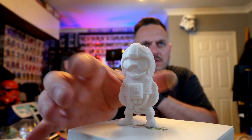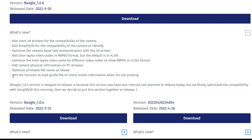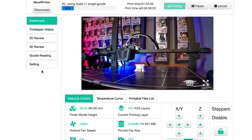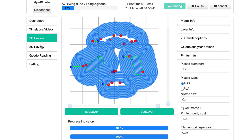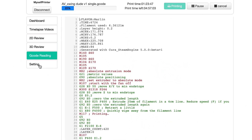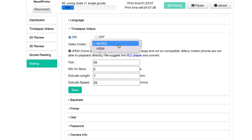The Beagle still has a little bit of work to do, so let's go through some positives and negatives. Number one: we certainly have ongoing software improvements — quality of hardware and adding software features will make this a clear winner. Number two: the web browser interface is pretty good, but I'd like to see more features, for example more time lapse settings in line with Octoprint, giving various settings and stop points. At the moment the head swings all the way forward and homes to the top left corner. On previous software versions it did this very quickly and was alarming to watch — they have slowed it down in later versions.